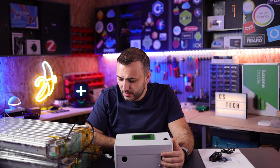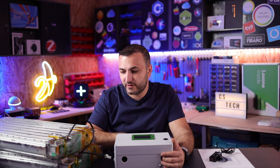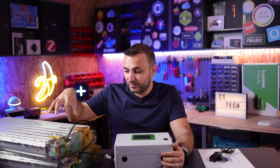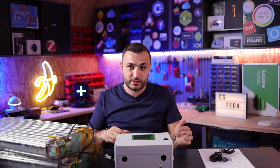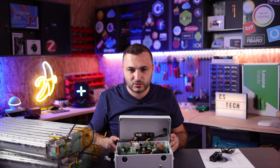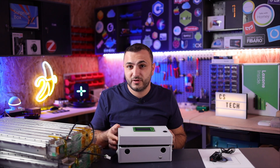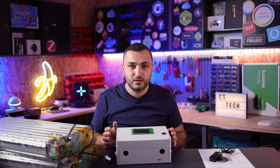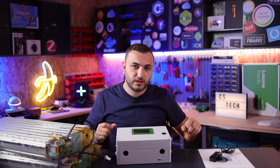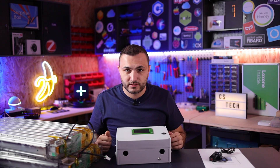The unit is very useful if you use Tesla batteries in your system. Do not use Tesla batteries without this BMS — it can burn your house, because if the Tesla battery is not charging and discharging correctly, it's a serious hazard. The contactor here will disconnect the battery if there's any problem. If the BMS detects the battery cannot be balanced safely, it disconnects the contactor and sends all the information via CAN bus to the Victron Energy.